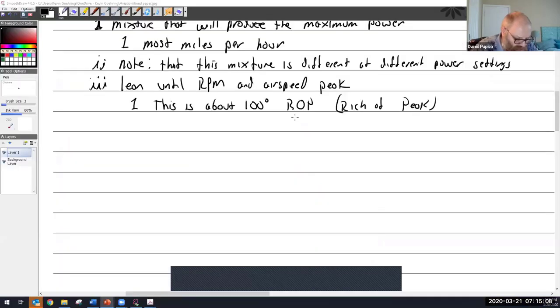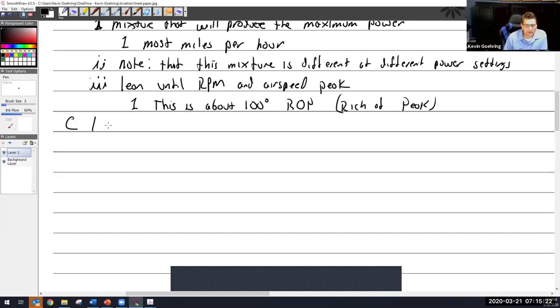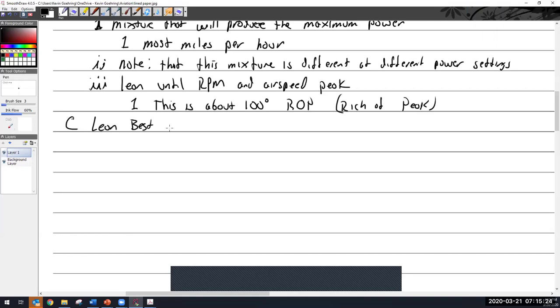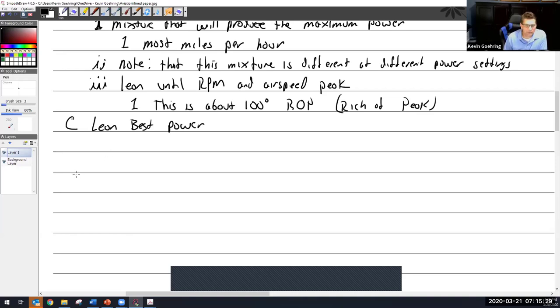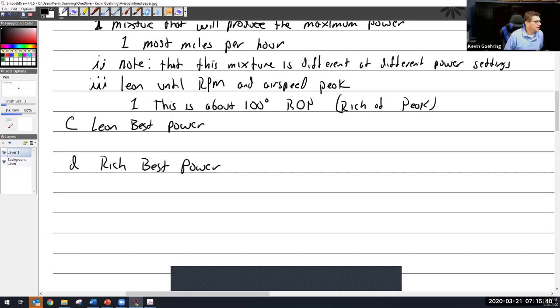All right, so that's 100 degrees rich of peak. All right, let me see. Then we have lean best power. Okay, so we talked about best power. Now we're gonna talk about lean best power. And let me see, I'll just do this right here. And rich best power. And I'm gonna pull a chart up for that one.